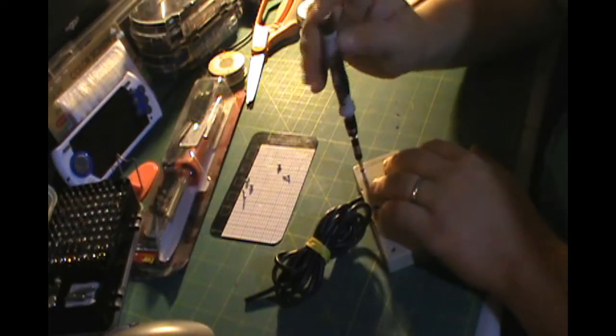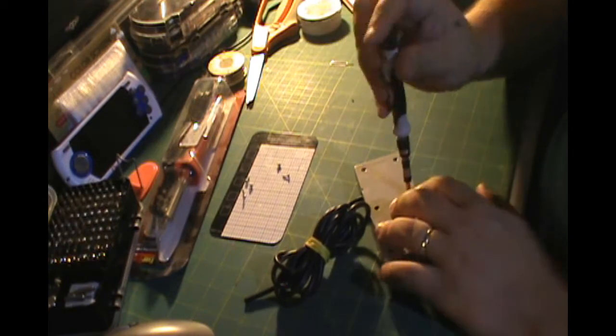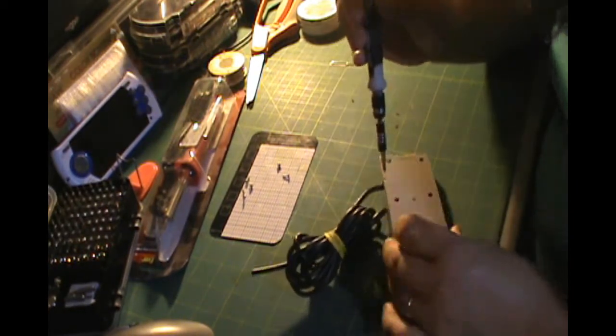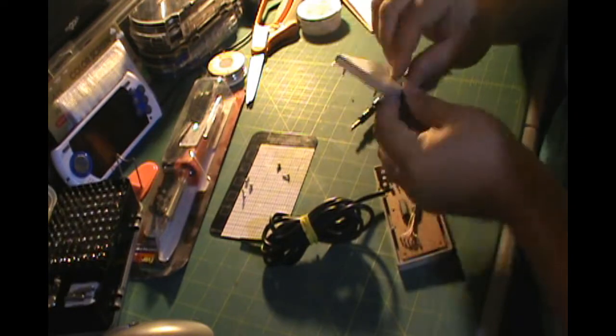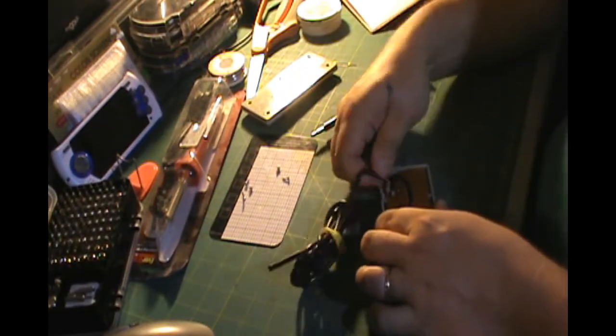Next thing I want to do is take apart my NES controller. I'm going to first look and make sure all the connections on the wires are still good, as well as take the motherboard out of the controller and change out the button pads. I might do a little bit of cleaning also. We'll see how bad it is.